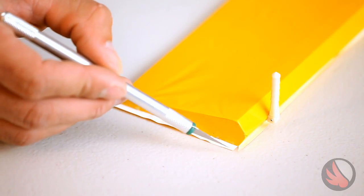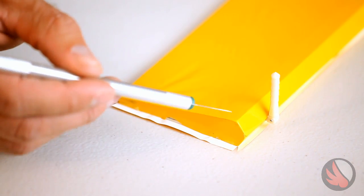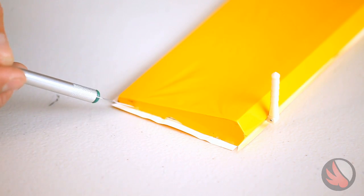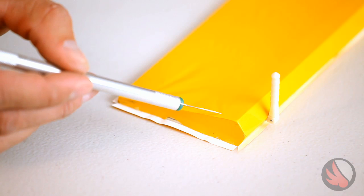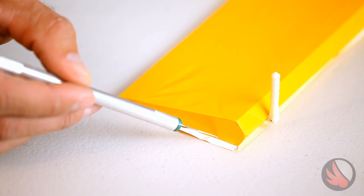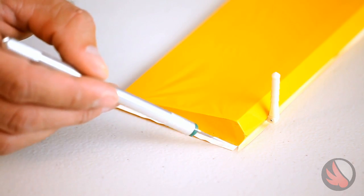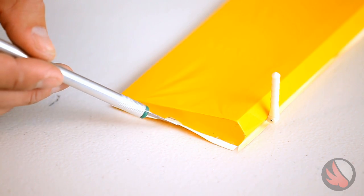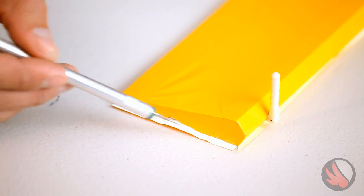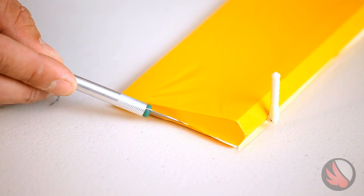So now what you want to do is cleanly trim your edge to the edge of the surface. Now in this situation, I was patching a covering piece that was already in place and had been cut flush with this edge. Normally, if you're covering this piece for the first time, what you may want to do is have this piece wrap all the way around and then slightly around this corner, and then just tack this top piece down flush so you could trim this clean and leave a clean edge. Now what I opted to do, rather than strip it and redo it all together, is just cut this a little longer so it folds over a little bit, provides a safe barrier, and is going to stick to this.